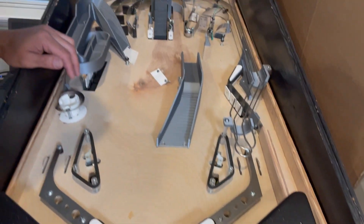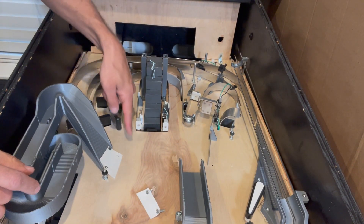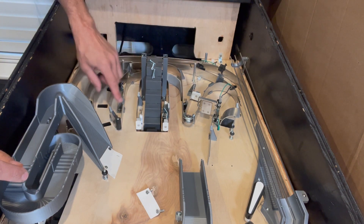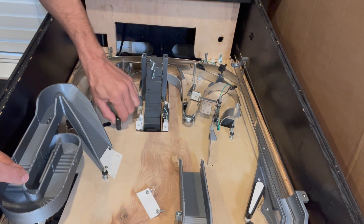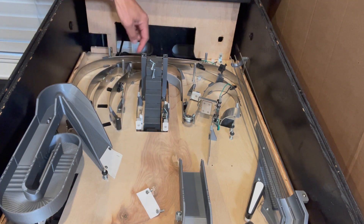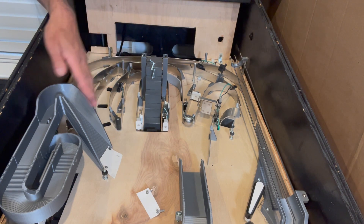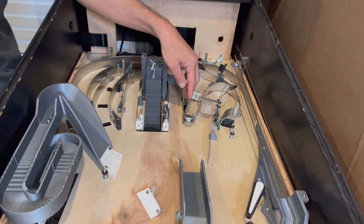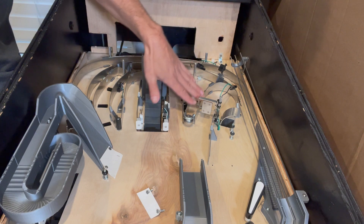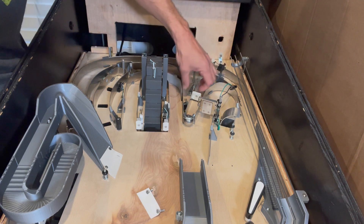Beyond the slingshots, further up the playfield there are other areas. The ball is supposed to go into these two lanes, but right in between there's a big gap between these metal ball guides where the ball can bounce up and get stuck — back in this little hole, along this side, behind this ramp, and up here at the captive ball. We want to cover the top of the captive ball area so the ball doesn't bounce out or another one hop in with it.